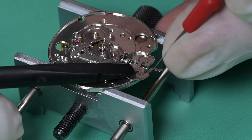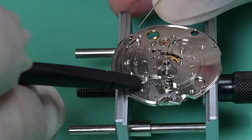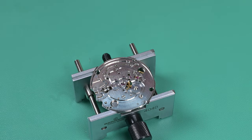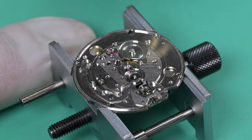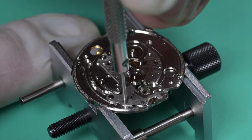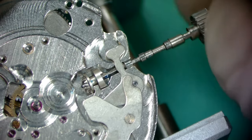For the purposes of filming, I'm lubricating this yoke with grease. Generally when I'm not filming I lubricate it on its edge, but having my hands more in the way makes it easier to hold the part — though if I'm filming it that way you couldn't really see anything. We're applying a bit more grease to the backside where that yoke spring is going to be in contact with the main plate. You saw me put in the sliding clutch and the setting lever, and then I'm cleaning up the excess grease with some Rodico — we just need it where the mating surfaces are.